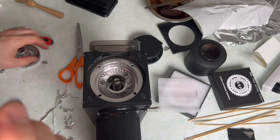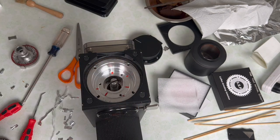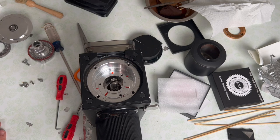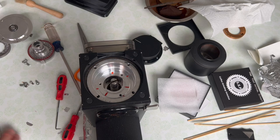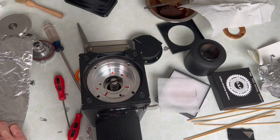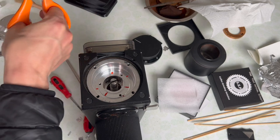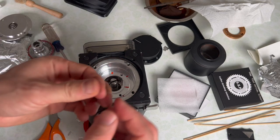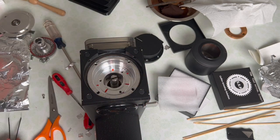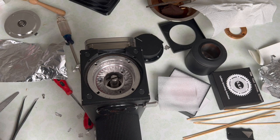The inner burr I'm imagining has the same issue. I can definitely see where the burr is making contact, and because of how thin this channel is, I'm going to start with a new piece of foil and fold them much thinner. Before it was 12 shims just to get it touching, but there's no guarantee it's machined to the same depth — it's likely a similar number of shims. I'll fold 12 times as thin as possible for the first fold, then go up to 13 just for good measure. I need to fit them in this very small region, so I'll cut them very thin. Using tweezers, I can insert this 13-layer shim into the burr carrier — that worked out really well. I'm going to do the same process for the top burr off camera and show you when it's done.